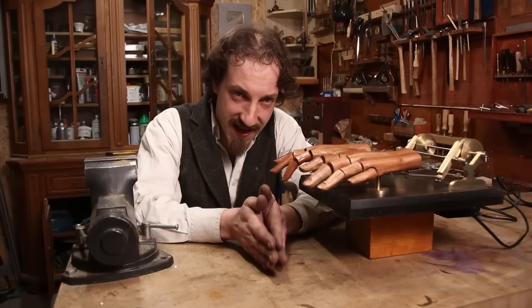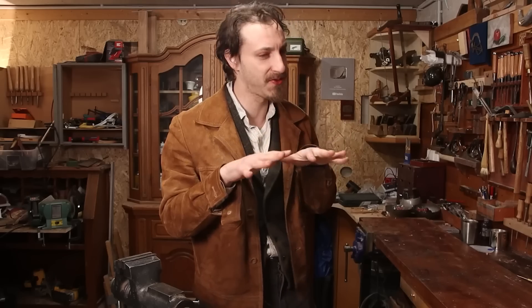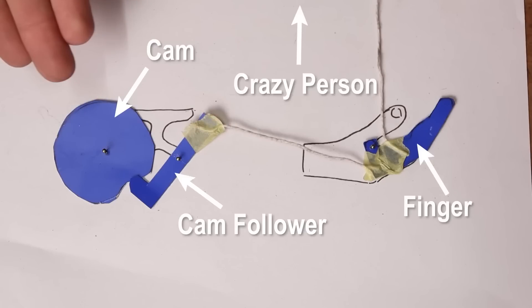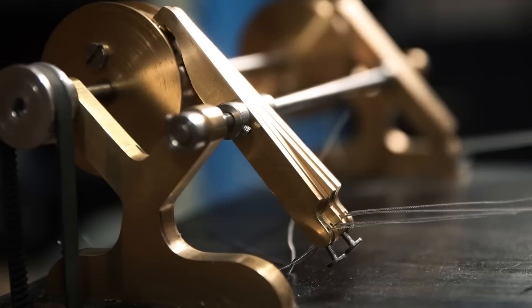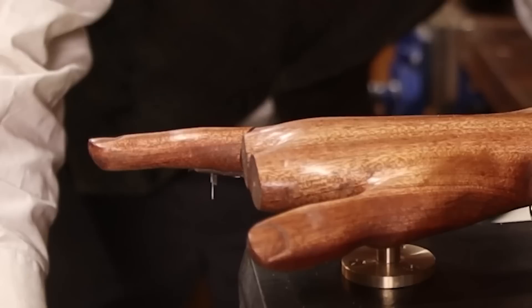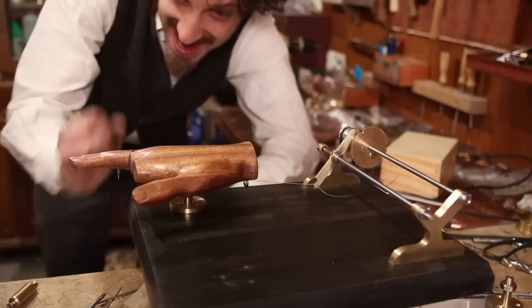Uri Terchman has built this Typing Hands automaton for a museum exhibit in Tel Aviv. He already built a similar automaton with a single finger tapping motion, but this is a much larger expansion on the original design. The motion is created by a cam and a cam follower that controls the tension on each finger. With the tension released, the finger drops into the keystroke before lifting back up again.